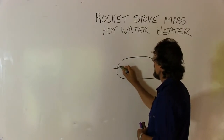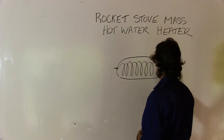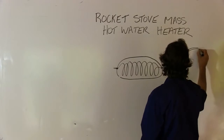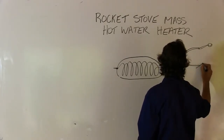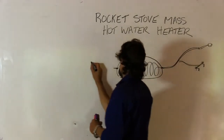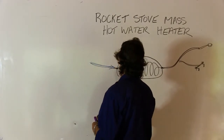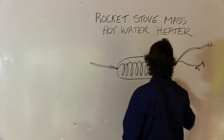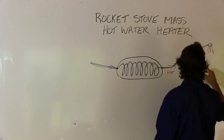Attached to those fittings you need to be able to thread in a coil of copper pipe, and this is the water you're going to be using for hot water showering. That goes out to your shower and end use — out to your shower and your hot water system, to your taps. Water comes in, goes through the pipe running through the middle of the system, and out the other end. By the time it comes out here it's actually hot water, and then goes out as hot water wherever you pipe it from there.